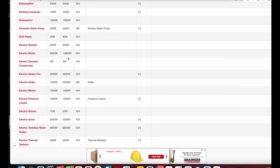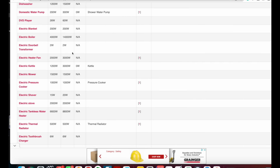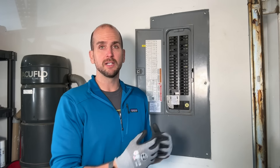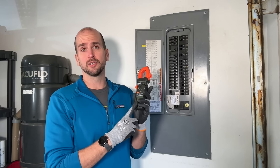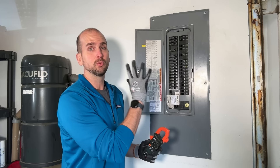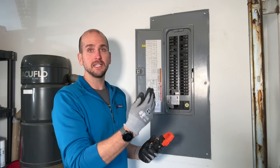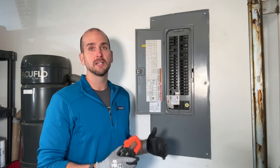What you'll quickly see is that anything with a heating element — like electric heat or a boiler system — is a massive amount of power. If I had that kind of setup and needed to go toward a maximum of 14,000 watts or 14 kilowatts, that would be well beyond my capacity for just that one appliance alone. Remember, you're not going to be running all the circuits in your house. The second method — the one I prefer — is using a current clamp to measure the actual amperage on your critical circuits, provided you feel comfortable working in a panel with the power on. I'll run all the different things I'd want to run in a blackout scenario and verify I'm below the amperage threshold for my generator and inlet box selection.